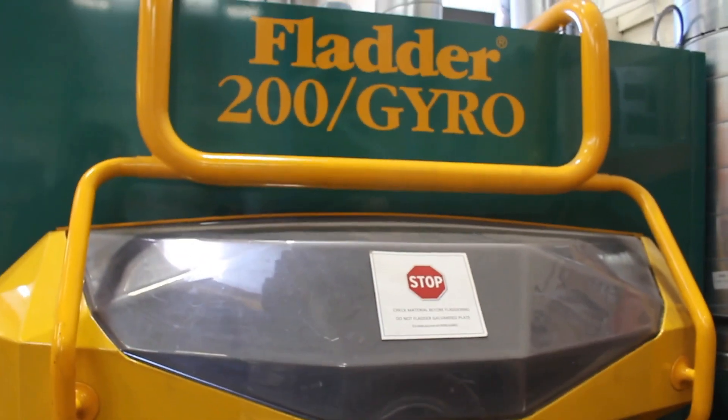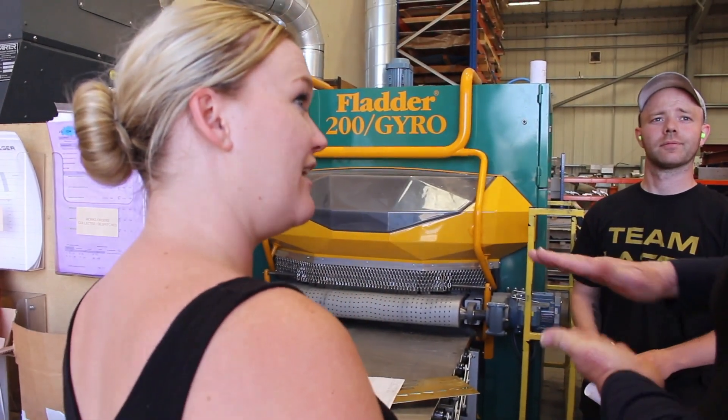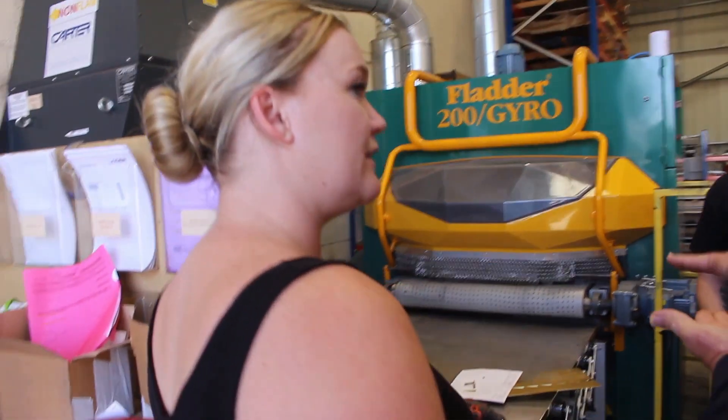Sometimes I'm still watching the laser — just watching it carefully. What we're finding is you won't get a consistent finish if there's a reflection issue. When the surface is shining, the laser is going to have a problem with it — it's a reflection issue with shiny materials. You won't get a consistent finish, and it wasn't until we identified this that we understood the issue.